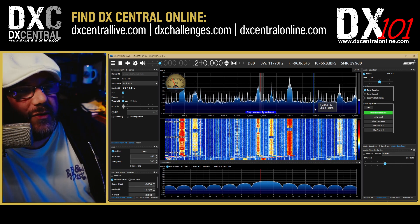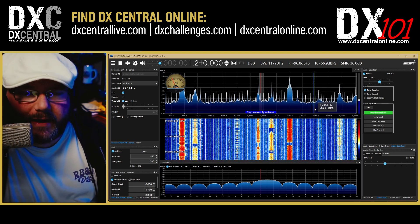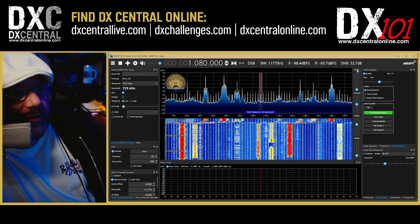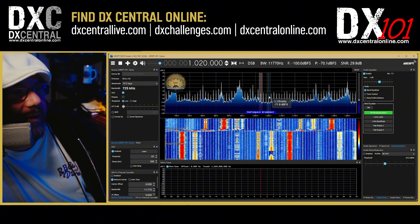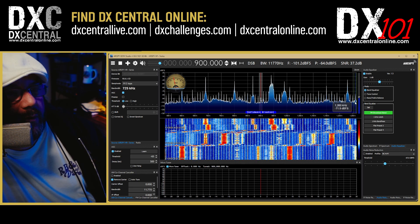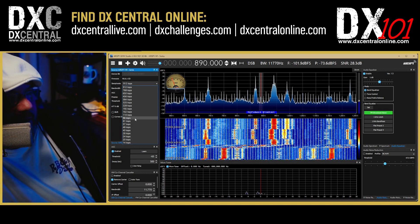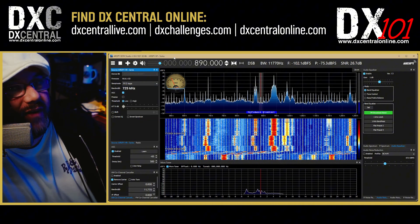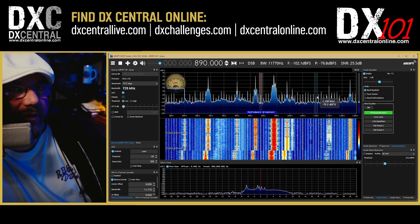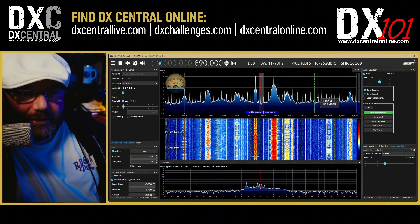If I'm traveling or doing sunrise/sunset recordings, I might say today I'll do the lower half and tomorrow the upper half, or alternate by time block. You can also go tighter on your sample rate to reduce your bandwidth and reduce your file size. If you only want to record from 540 to 700, because you're targeting specific frequencies or stations, you can absolutely do that — it'll reduce your file size and there's less to review later. So 890, 900, 1240, or 1340 depending on what you want recorded — that's how you set your center frequency and bandwidth.